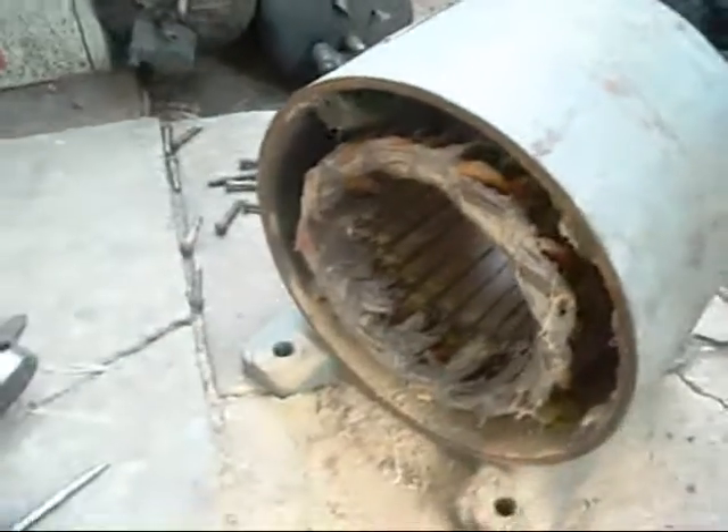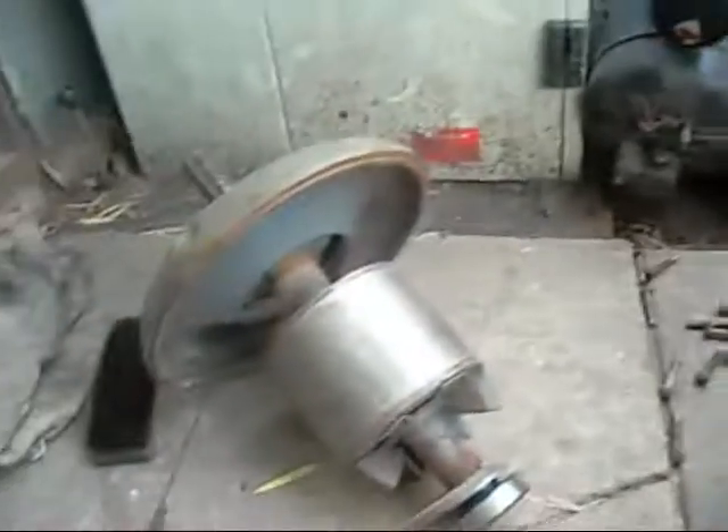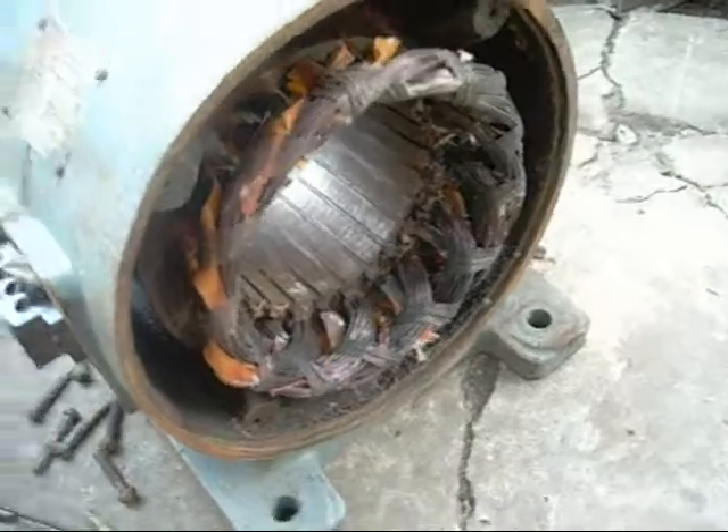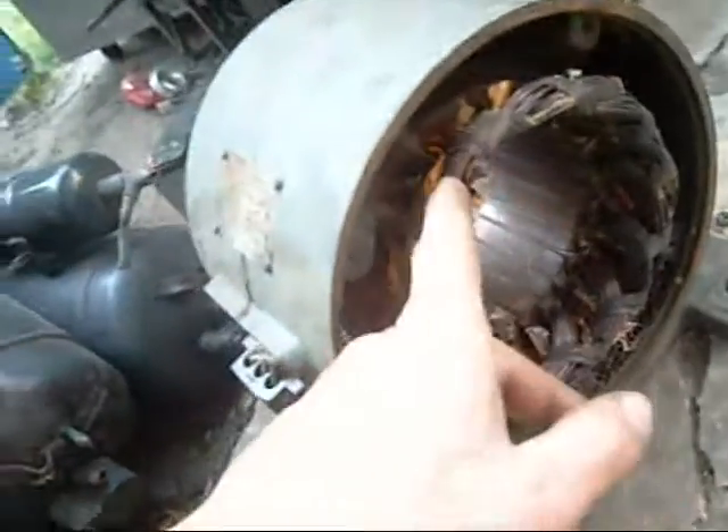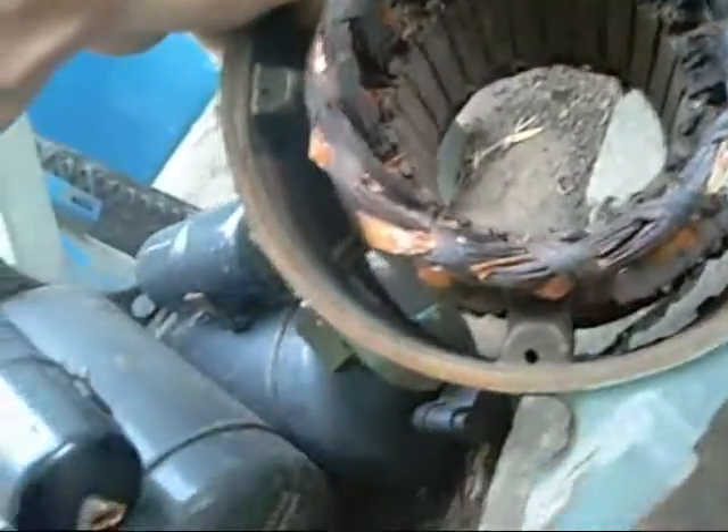The rest of that is just going to get blown out and that's it. Nice little stator. This side of the stator does look a bit blackened, but the lacquer they've used is pretty dark in colour as well, and it's seen a fair bit of use, so naturally there's going to be some heat discolouration. Not 100% sure if she's alright, but she seems to run fine. It's time for the reassembly and three-phase test.